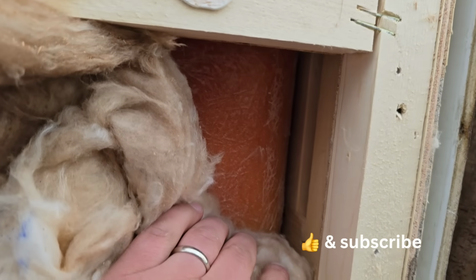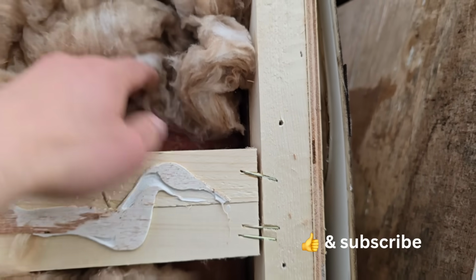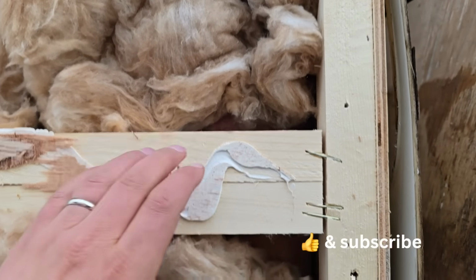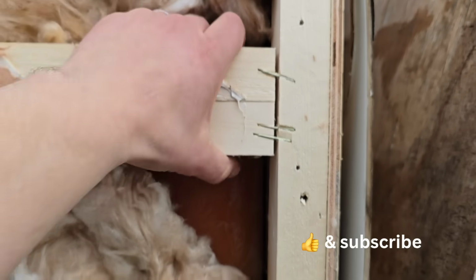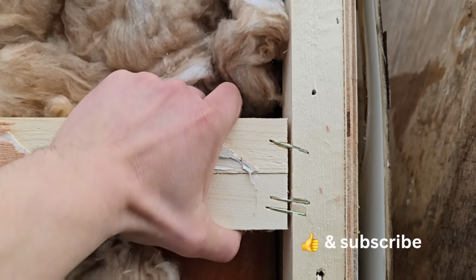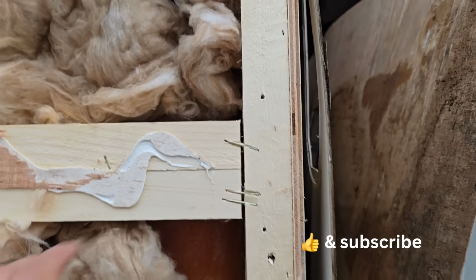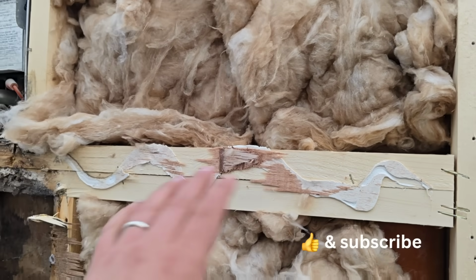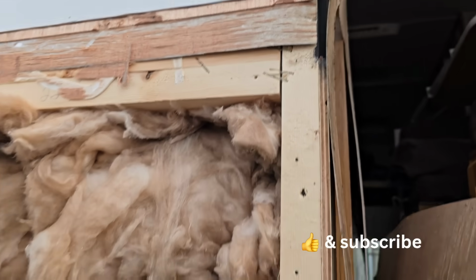Look in there, right? This is all cut out for weight. All of it's cut out. And so you have a shower stall right behind that. You have this right here. Look, I can do this with my hand. That thing's moving, right? So there's a tremendous amount of movement there, and there's no shear strength on that back wall. Zero. No shear strength, except in the sheet material on the face.